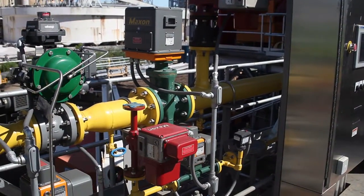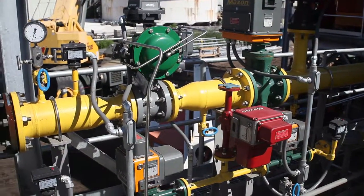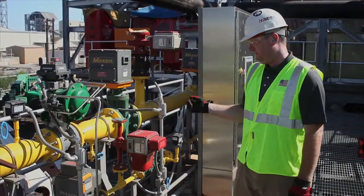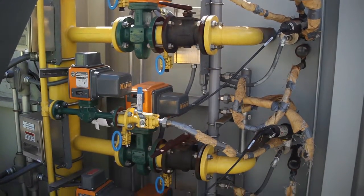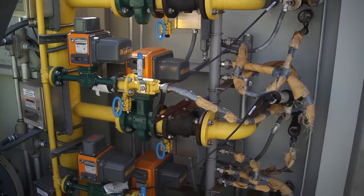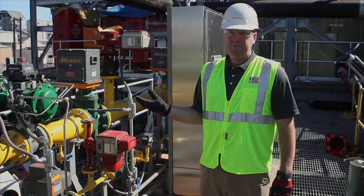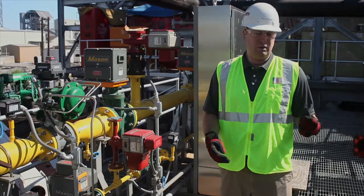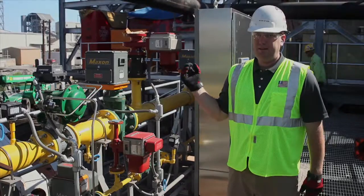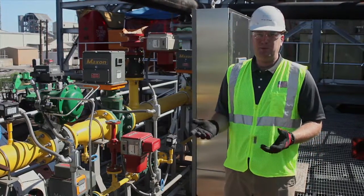This is the duct burner skid. It'll be fed by a 6-inch natural gas line, and then from here it runs over to the duct burner on the boiler. So the basic process here is Rayonier is going to take the steam that this produces on just normal operation of the turbine, and if Rayonier is normally operating, they're just going to take a smaller amount of steam.